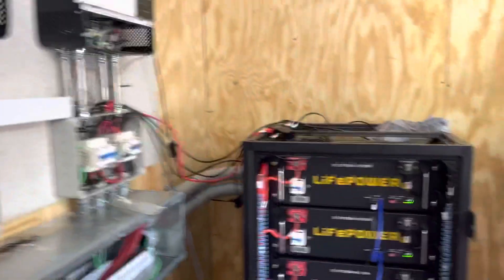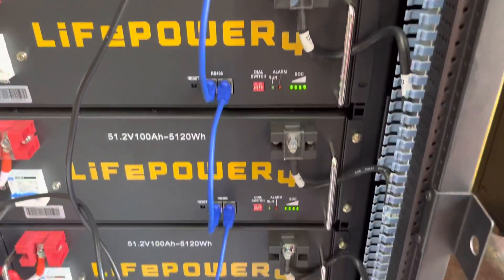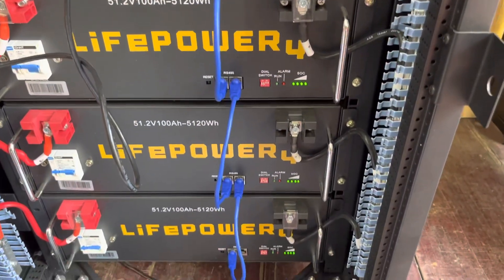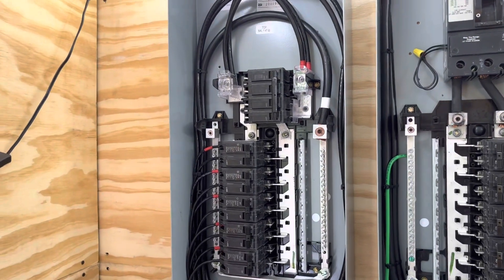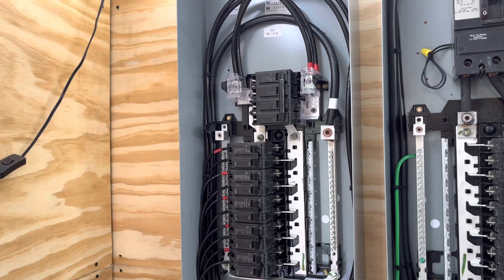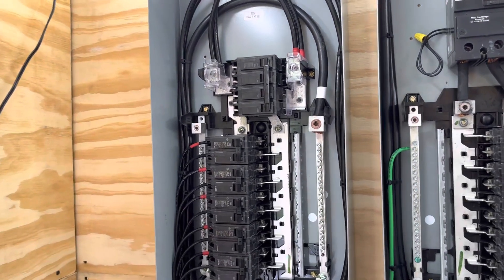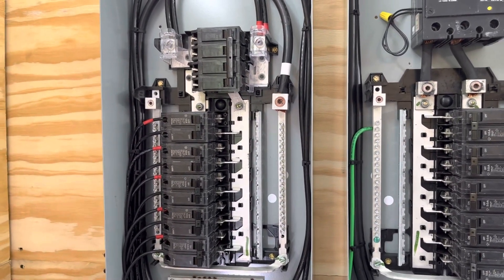It's really not that much. The batteries are all at 100% state of charge, so it could be a good test. Now I still don't have my PV arrays hooked up. This is strictly on the grid, but this is going to test out my battery bank and its capabilities of powering my house and for how long. I'll flip this breaker off here and that will kill the utility input to my inverters and make it switch over to the batteries.